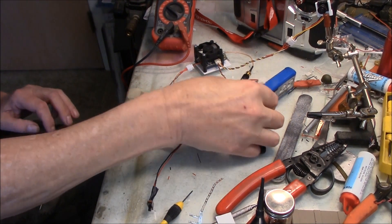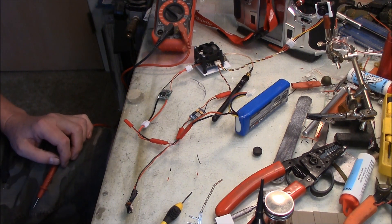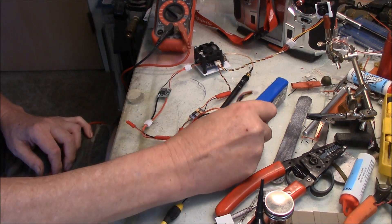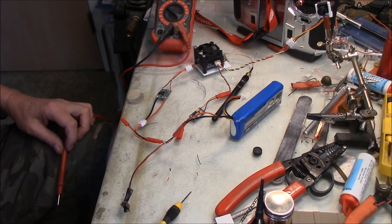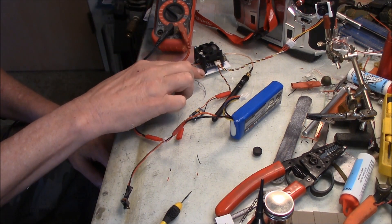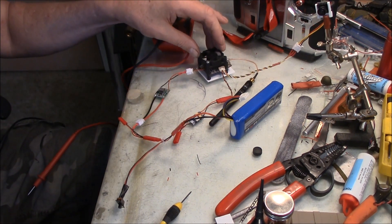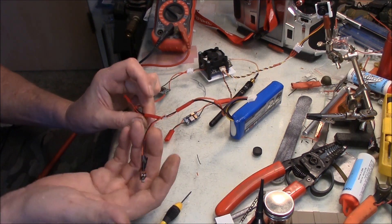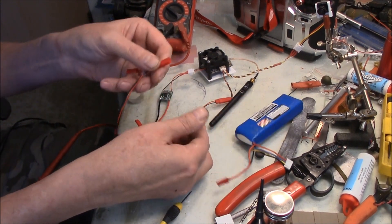What I've got here is a 12-volt battery — it's a 12-volt transmitter pack that I use for my Turnigy 9X and 9X Pro radios, so I had a couple extras and decided to just use one. It's only a 1.5C but that's okay because you're not going to have a huge amperage draw like you would on an electric motor. One of the problems I had is that the transmitter runs off 12 volts and my fan is a 5-volt fan. I could hook it up straight at 12 volts but it screams like a banshee, so I didn't want that.